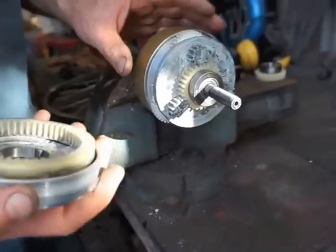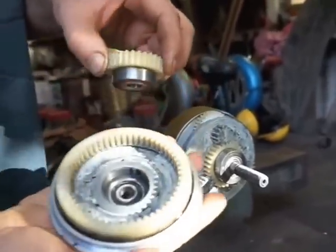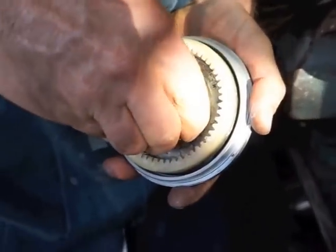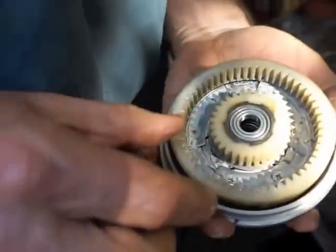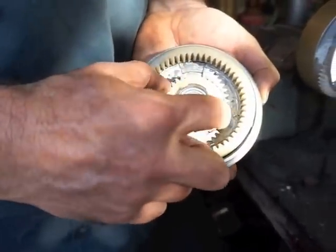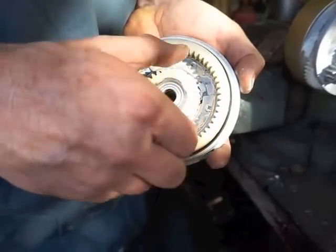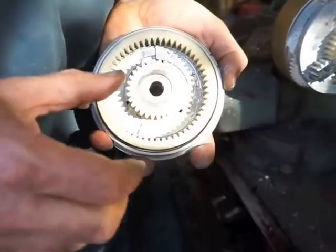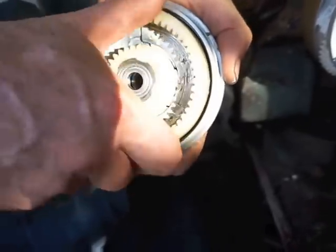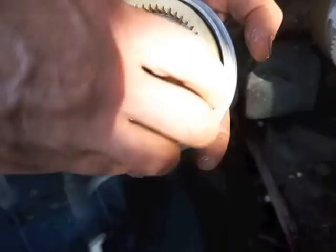The way it does high speed is very simple, really. The nylon sun gear in the secondary gearbox — here's the spare one — fits into that socket in the middle of the side plate. So here's the sun gear in the secondary gearbox in its place. It's sitting there in a freewheel. When it rotates one direction, it just freewheels. When it rotates the other direction, it grips and turns the side plate. The ring gear works the same way — when it rotates this direction, it freewheels; when it rotates this direction, it grips and turns the side plate.